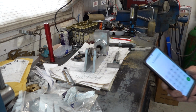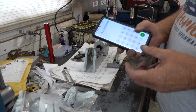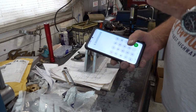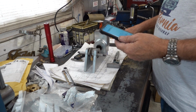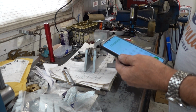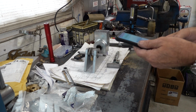Yeah, so we're 32 divided by 6 for 5 parts piston movement, 1 part compressed air pocket. It's 5.33 and I've got 6.3, which means the compression will be lower, which is probably going to be better because they say 4.5 to 1.